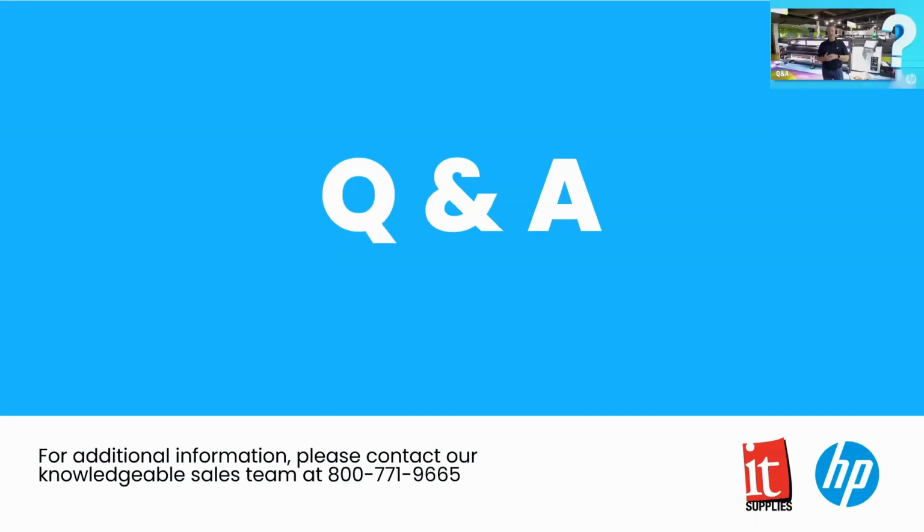That's a good question. So in Gen 3, you had to stock a print head for every color, and that is because the ink came inside of the print head. So what we changed with Gen 4 print heads is that instead of putting ink in the print head, and the reason we were doing that is to have fluid in the print head so we don't introduce air bubbles into the print head, we decided to change that and just put a clear shipping fluid in the print head. You only need 3 print heads for this printer: an optimizer print head, a white print head, and a universal print head for everything else.